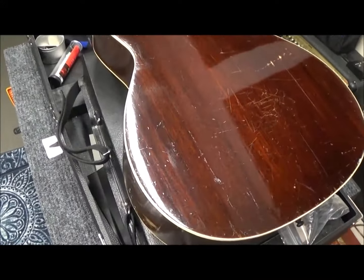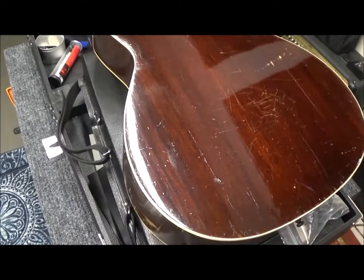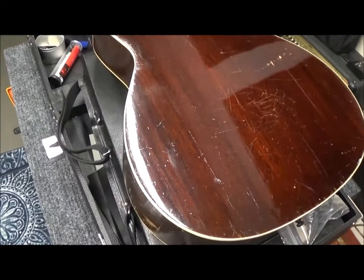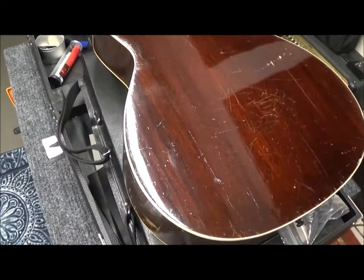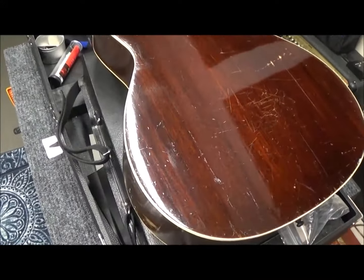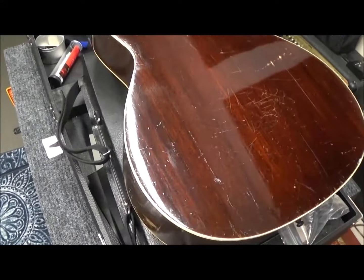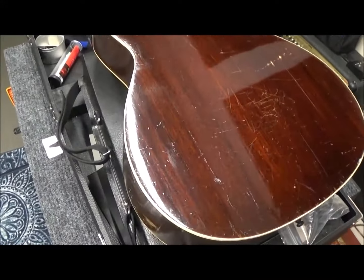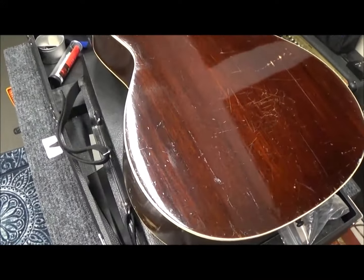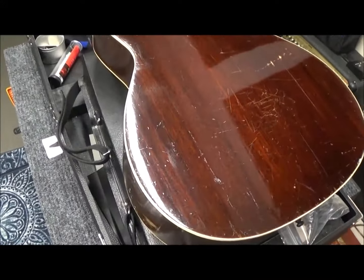As far as blushing goes, I did get a little blushing around the sound hole because I laid my towel right down on the body while steaming — that was stupid. Never leave a towel sitting on top of your lacquer while you're steaming. But I gave about four shots of lacquer at 12 inches away and it almost completely went away. The only blushing left — it was milky white all through there — but all you can see now is that one little line. I'm in the ball park, measuring about 5/64ths.